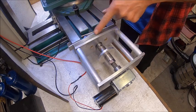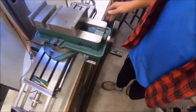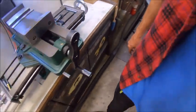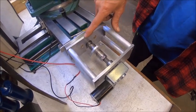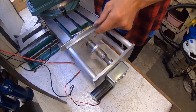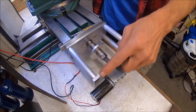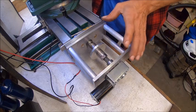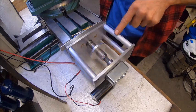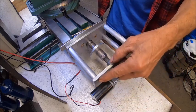In my first video I showed where I had milled down that collar that was on it - like this collar over here - it had that on the end of it and I milled it off. Because of the way I had to mount this aluminum to it, I decided to go ahead and take that back out and mill the whole thing flat, so this would mount up against it with no voids. I made that plate there and then I made this plate, and both of these were sandwiched together and drilled exactly the same - same size, drilled eight millimeters in.